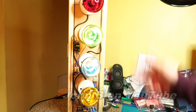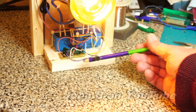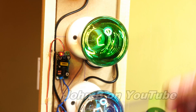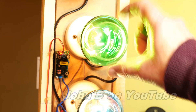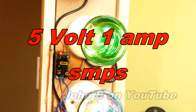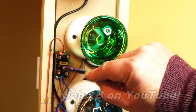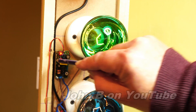So I'll show you the quick and dirty way I've got this going. I'm using an electret microphone that costs a pound from eBay. These four QTX bulbs, they're 60 watts, 80 millimetre diameter — you can get 100 watt. There's a 5 volt power supply in there. I initially had the microphone amplifier running off four AA batteries, but then I bought one of these. These are only £1.50 to £2, so that does away with batteries.